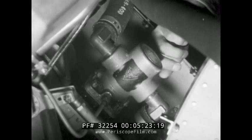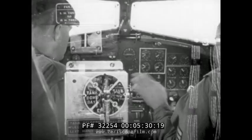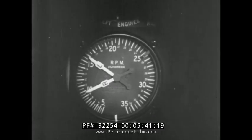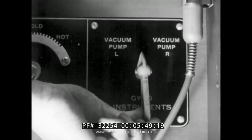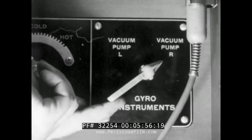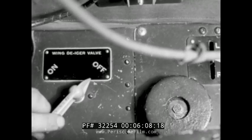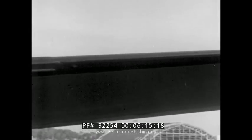When the test is completed, return the control switch to the mid position and the selector valves to off. Test the operation of the engines on each magneto, noting loss of RPM. Then, at about one third throttle, turn the ignition switch off to see that it's working — it must be turned back on immediately. The vacuum pumps are tested by setting the selector on left and right and checking the vacuum pressure gauge. The heater control is operated to the limits to check range of movement. Test the de-icer mechanism and have the observer outside check the functioning of all cells along the wings, horizontal stabilizer, and vertical fins.